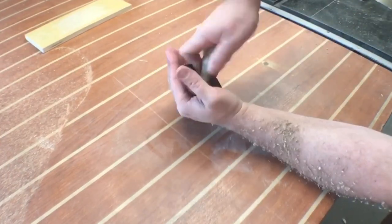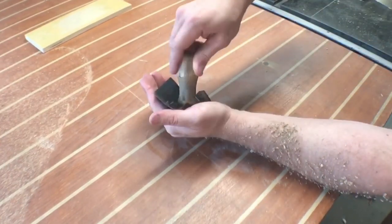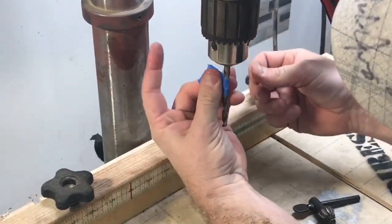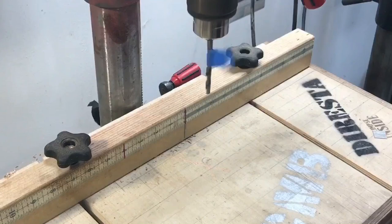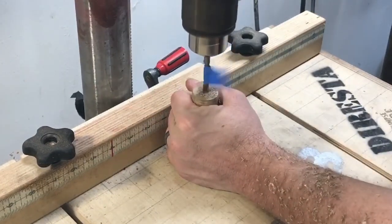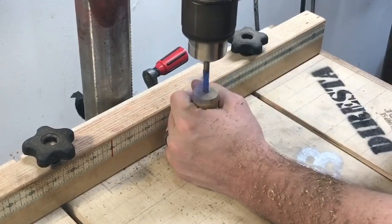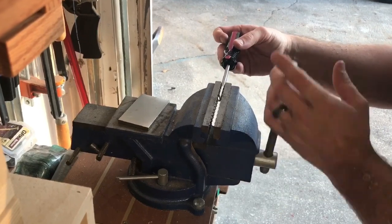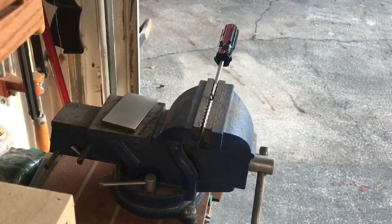Put some sandpaper down on a flat surface or use a sanding block to trim up the end where you just cut from the bandsaw. I also like to take a piece of 400 grit and break the edges on the piece that was attached to the screw chuck. I'm installing a piece of blue tape around the drill bit as a reference mark to make sure I don't drill too far down into the handle. This drill bit is also one half millimeter smaller than the actual diameter of the screwdriver shaft, so you get a really nice friction fit even though we're going to use epoxy when installing.